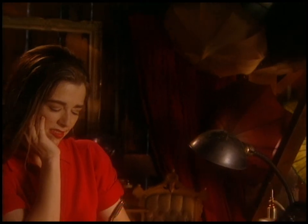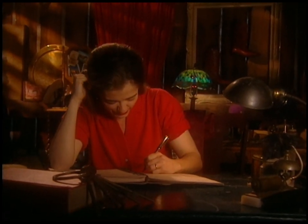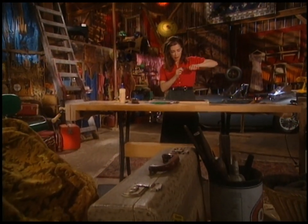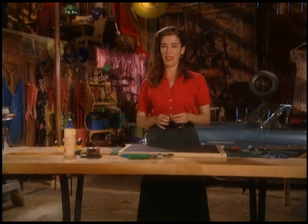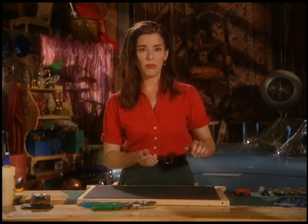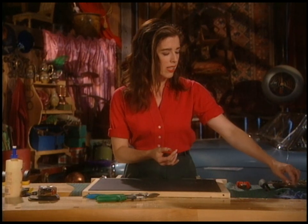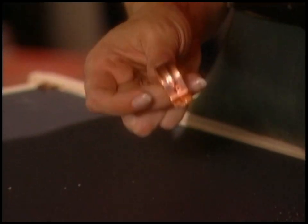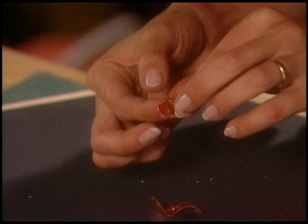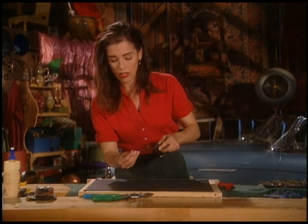That person who looks back at you from the mirror may have your eyes, your clothes, and your thoughts. But some days it just takes a lot of nerve to say, 'Hey sugar, looking foxy.' However, if you can glance into the mirror and say, 'I feel okay, so I must look good,' then you're probably on the right track. I almost have my mirror finished — my shelf and bracket mirror — but I'm homemaking some clips to hold the mirror in place on the back. The mirror clips they sell are big clunky plastic things that stick out so far the whole thing will be held away from the wall. So this is actually a plumber's clamp — you just cut it in half. They cut pretty easily because they're copper, and then you use some pliers to bend them around and nip them a bit, and you get a nice little bracket that fits right on the edge of the glass. Then I'm just going to use a brass screw to put it in place.